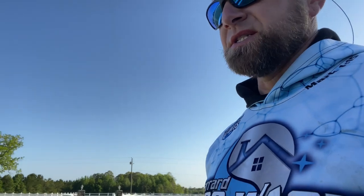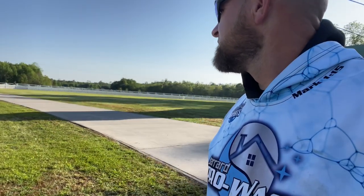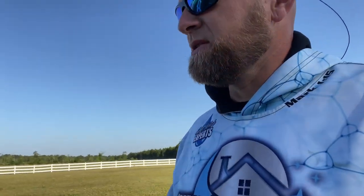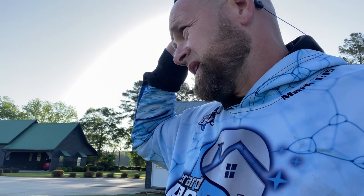You can see that the fencing is clean all down through here, except for the bird poop that's taken over. That's what this fence looked like — just like the section I showed you earlier. We pre-treated it with a three percent mix, let it dwell until all the lichens had turned light brown or white, and they literally just get blasted off with the turbo nozzle. But you'll have that stain left behind — it's kind of annoying. Once we did post-treat it, like Derek had told us, it looked great.